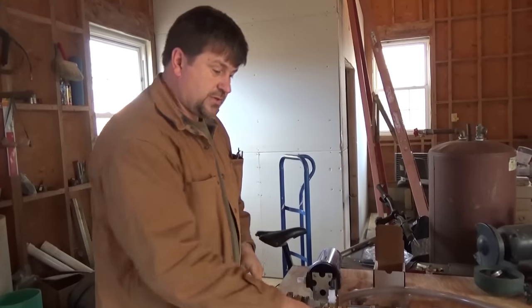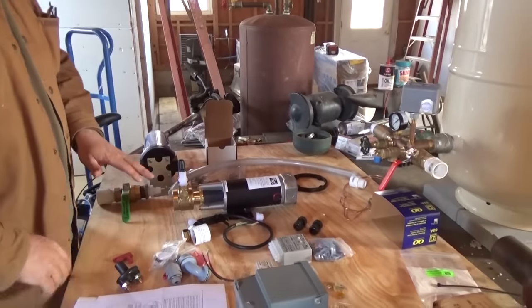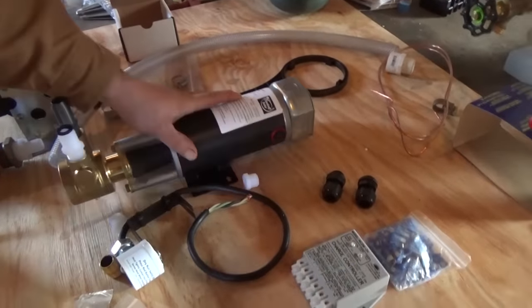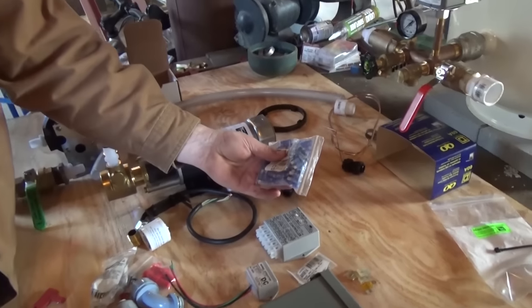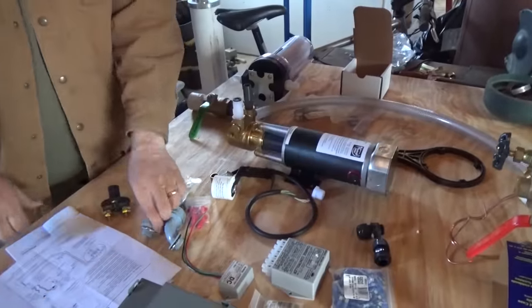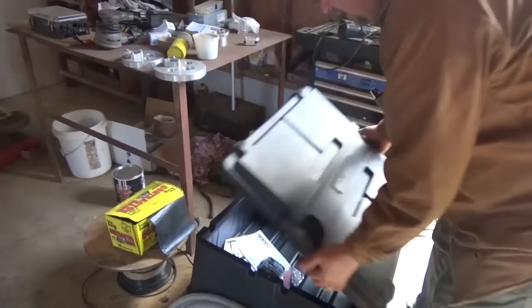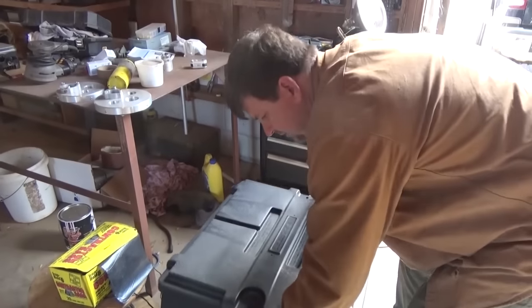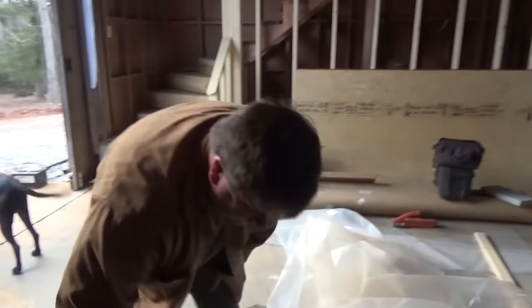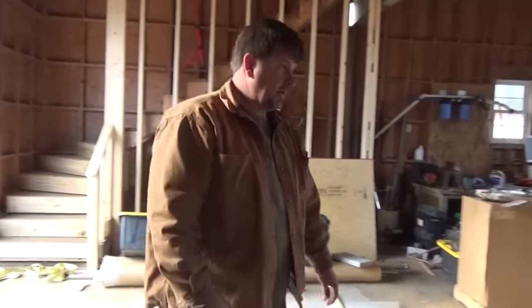This is a solar water system — solar charges the batteries through the charge controller, and the pump runs directly off the batteries. We do a standard 30/50 pressure switch and make sure everything is fuse protected. It's 15 amps, so we use ATC fuses with inline heavy 10-gauge fuse holders, cord grips where needed, and conduit to dress the system up. For batteries, we're using a maintenance-free setup in NOCO 8D battery boxes — two of them to make a 24-volt, 245 amp-hour bank. I get the Parker flexible potable water hose in 50-foot rolls.